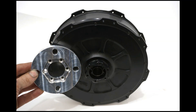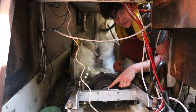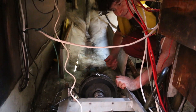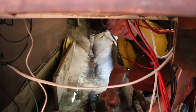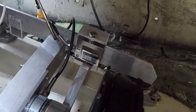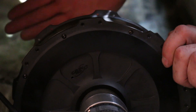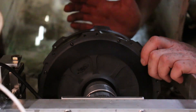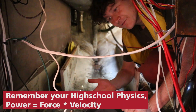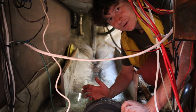On the back side of the motor you'll see that I've also got additional instrumentation. There's a load cell — a very precise device for measuring forces — that's able to measure how much force the propeller is pushing on the boat. Once I add the circuitry, I'll be able to know how many pounds, newtons, or kilograms of force is pushing forward on the hull. If I know that information and the hull speed of the boat, then I have an exact measure of the mechanical power output of the propeller.